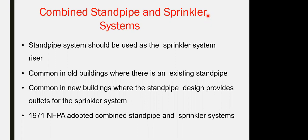Is it costly or the same expense? It's costly. Of course. NFPA doesn't ask you to make it split or combined. It's a design parameter. It's value engineering, or a decision on advantages and disadvantages, which one is suitable for you. If you have a standpipe and vertical riser alone on the staircase, away from the protected area of the sprinklers, I have to make one separate and one. You don't have a choice.